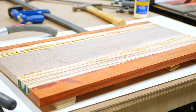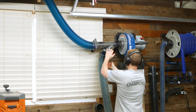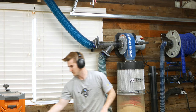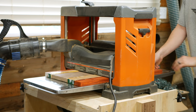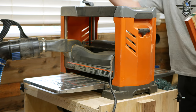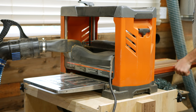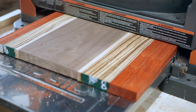The next day I could plane things down. The cauls were really effective in keeping things flat, and my goal for planing was only to remove the glue and a single thin layer of wood. So I did passes on each side to remove the glue and only turned the knob about a quarter turn each time to minimize the amount of material removed as well as prevent any tear out or snipe. It left me with a really smooth surface — it helped having basically brand new blades on my planer.